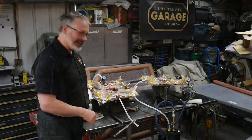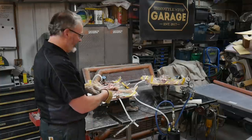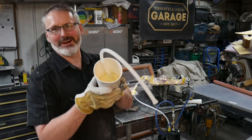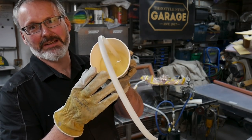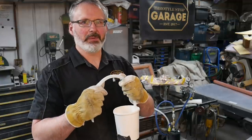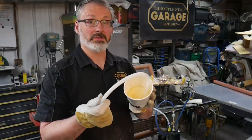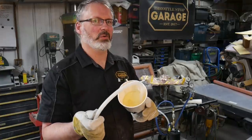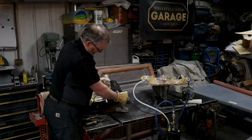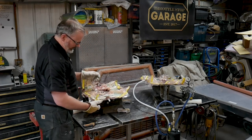As always, it's the next day. I've been dying all day to get around to taking the bag materials off these and finding out how we did. So let's get going on the first mold — the little piece that's going to go underneath the front of the manifold. I didn't do so well at estimating the epoxy for this one — it was a little tricky. The mold is quite small, so predicting how much epoxy was needed was a bit off from where I normally am. This was about two and a half times the weight of the fiber; usually on a bigger mold it's more like 1.3. Just a little tip.